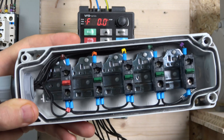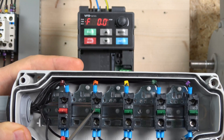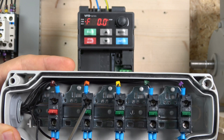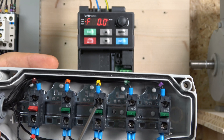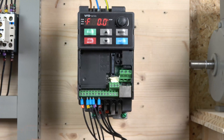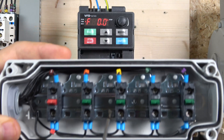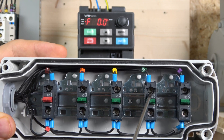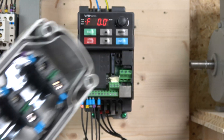When it comes to wiring, DCM comes into our normally closed contact, goes through, and powers all the buttons with normally open contacts. The first one, M1, is the run signal. M2 is available — you can still use it for a reverse signal if you wish, and there's another input left over if you want to add jog or something else. We are using M3 as bit 1, M4 as bit 2, and M5 as bit 3.